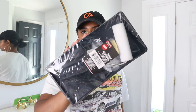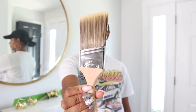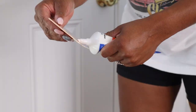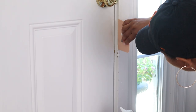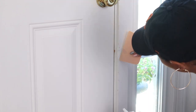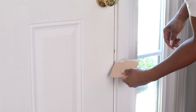Good morning — it is day two of this foyer makeover project. I went and checked all the doors and everything looks really good, so I don't need to do any more coats of black. I'm going to get started on the trim. I picked up this tray from Dollar Tree and I'm using a two-inch angle brush I already had. A piece of wood chipped on the door frame, so I'm using plastic wood to fill in the spot — I add a little onto the spatula and squeeze more into the spaces, smoothing it out until it looks even with the rest of the door frame. I let that dry until it's hard.